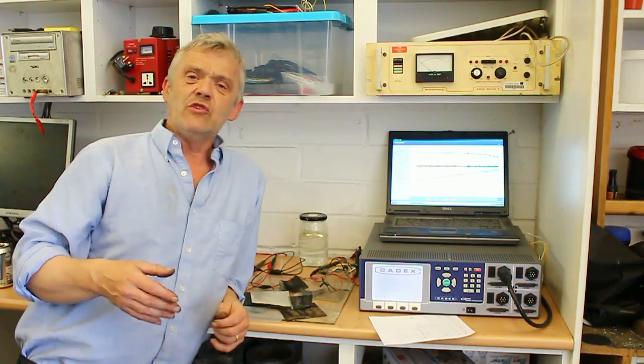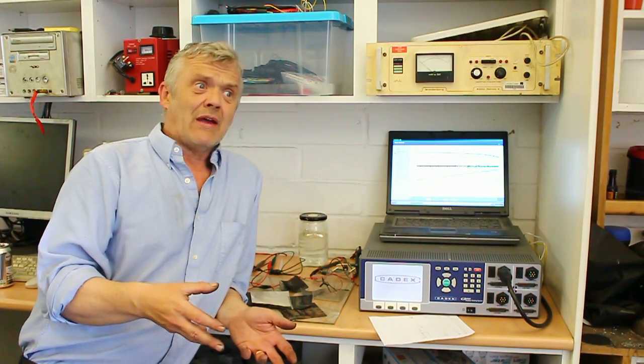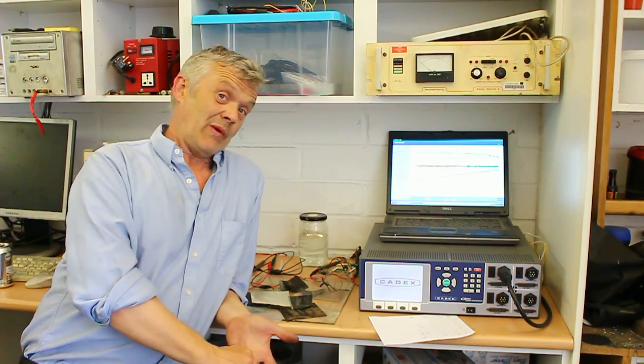What we'd like to do, obviously, is claim that extra bit, so 2.4 to 1.8 that we're missing, because there's a huge amount of energy there, and sooner or later, I suppose, we'll get round to it. But in order to finish this section, to show you what we're doing is actually creating batteries that are cheaper and more energy dense than what's already out there, I think we've done that. Our old tyres, costing about $4 a kilowatt hour, come in more energy dense than a lead acid battery.